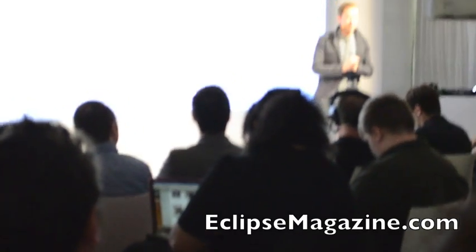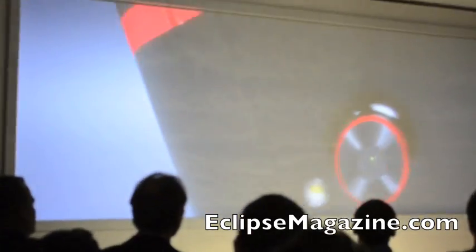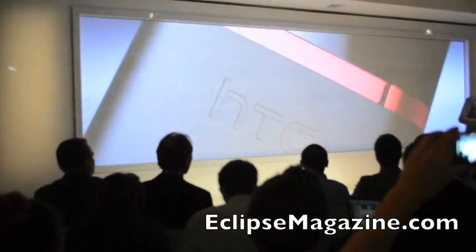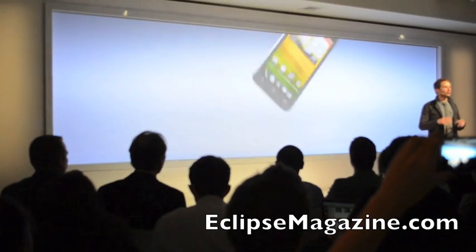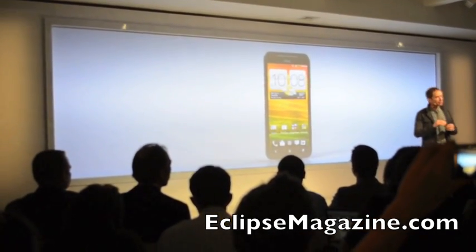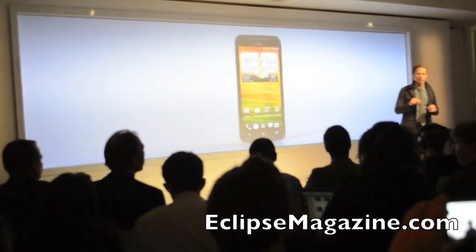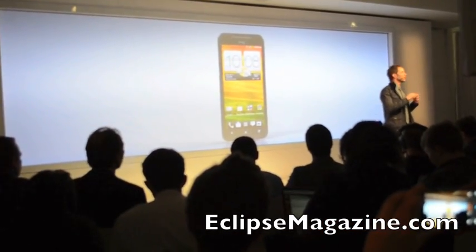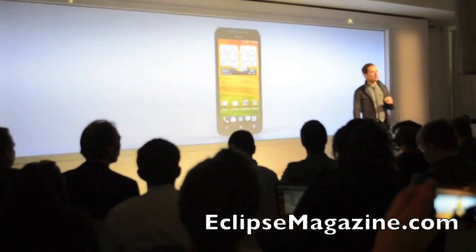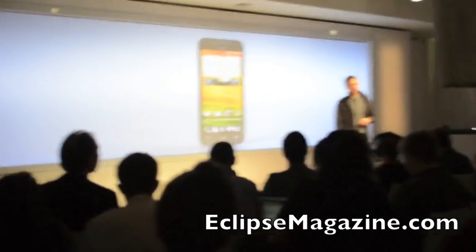The new Evo is crafted from an aluminum space frame. This means that it feels both lightweight yet sturdy when you're holding it in your hand. The aluminum is first anodized to a beautiful black metal finish. Then we machine off the surface of the edge to expose the natural metal underneath, forming a bright ring around the perimeter of the phone. The result both highlights the thinness and gives a detail that you've never seen on a phone before.